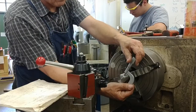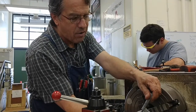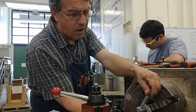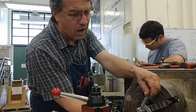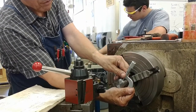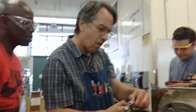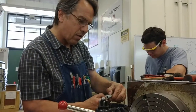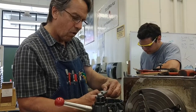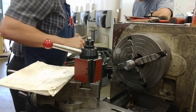To measure accurately with the thread wires, you tighten them until they are a friction fit over the thread. They'll actually stay in place, but you can slide the anvil through the thread. And I'm seeing 1 inch 447 thousandths.